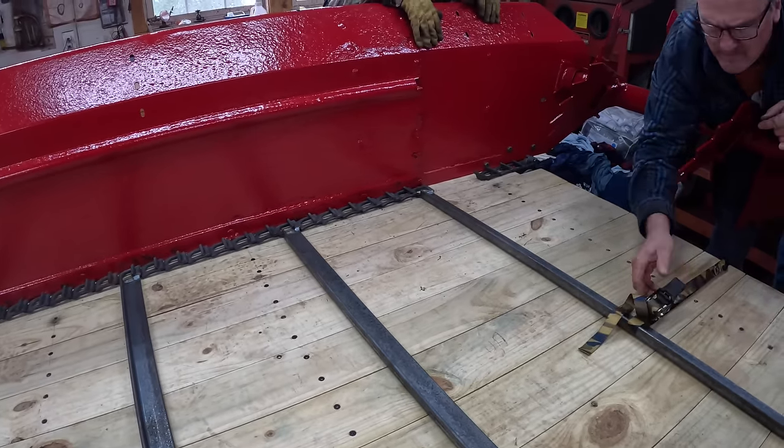This has bugged me ever since I got this spreader. There's the teeniest, tiniest little lip here where it must be a worn PTO shaft ran on this coupling, and it makes it hard to hook up. And it just needs to be filed down. Just need to take the time to do that. I think I got it.